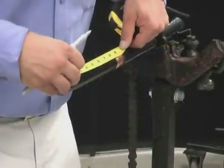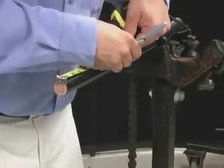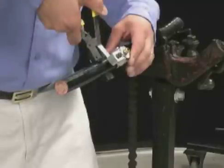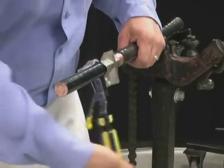Make a mark on the cable at the defined dimension. Hold the cable in one hand and press the lever on the banana peeler. Place the cutting blade at the desired depth, which should be less than 90% of the semi-con thickness. The spring-loaded jaws will close on your mark and the blade will penetrate the semi-con layer. Rotate the tool around the cable to make a 360-degree square cut.